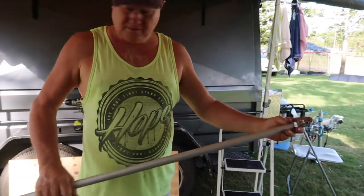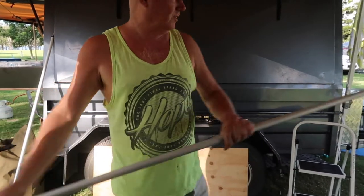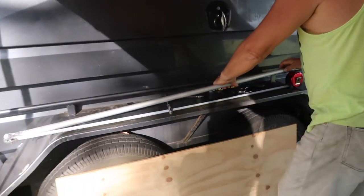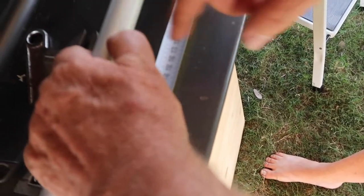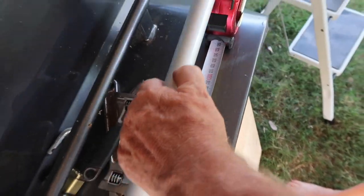What we're going to do - this is solid here - so the first thing is to cut this off the right length. I'll mark it there. It has to be less than that, including the other piece it goes in. The one I did was 1150 long, so if I make this the same - there we go, it's 1150 - that leaves a little bit of space for the other pipe to go inside.